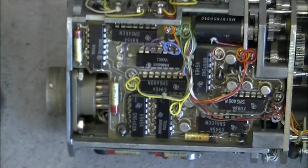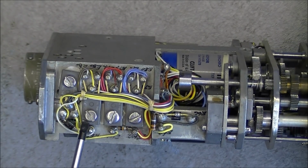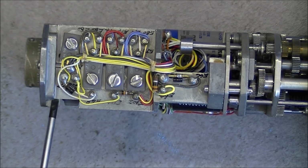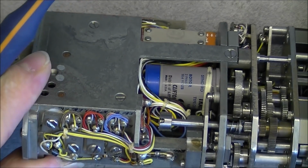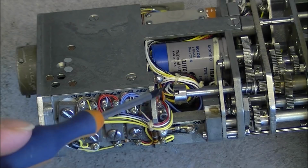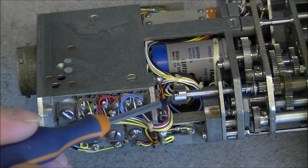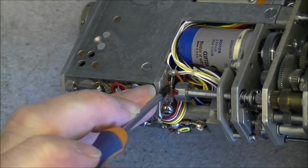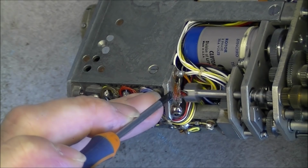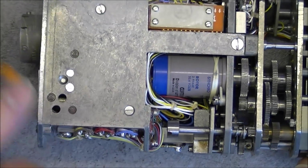So there is a seal here at the back. I am removing it because it is a little bit annoying. On this side we have power transistors bolted to the frame for heat dissipation, and we have some kind of feature here. Ah, yes, it must be probably the remains of a setup with a magnet and a broken reed contact here in a glass bulb, but it is broken. But probably it was a test feature with a magnetic switch. The sensor here, synchro transmitter by Clifton, very regular stuff.